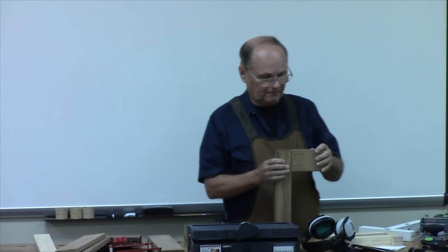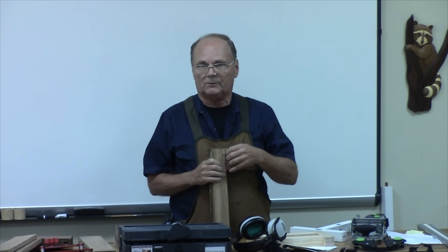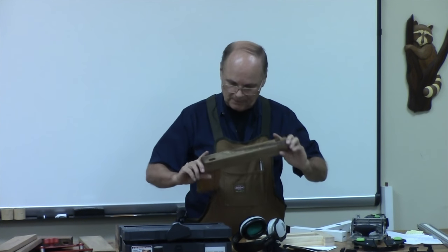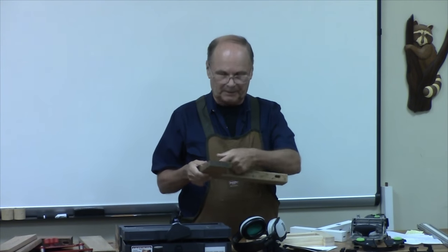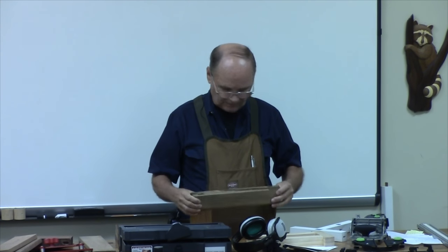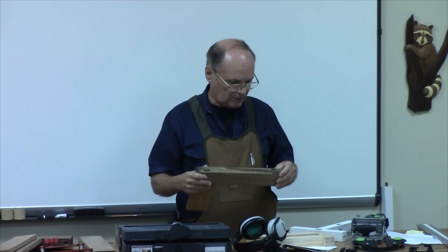This one I want to show you — it's just my way of demonstration. It's the same timber; I just put some brass pins in it and we can pull them out. All this is is that the mortises have been cut in each side, then I clamped it together and drilled holes to put pins in — there's no glue. This shows the setting to let it be a little wider. Sometimes you have to do that. Here's the tight fit; here's the looser. This also shows how close you can cut to the edge.